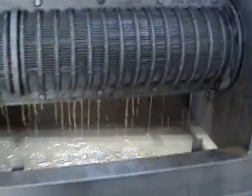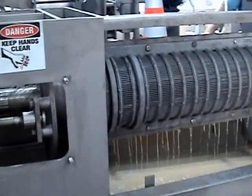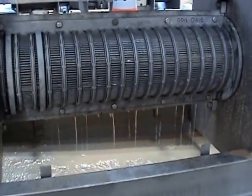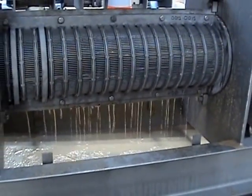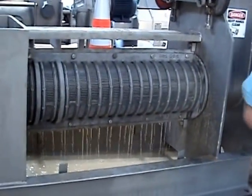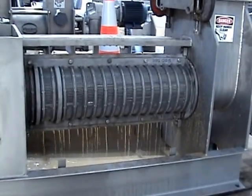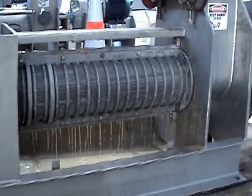We've got some material in the inlet hopper and getting some dewatering. In a few seconds, the screw is going to stop and the press is going to run backwards. The screw ramps up to 120 hertz for about five seconds. When we go backwards, we're wiping the screen clear with the material that's in there — we get a heavier flow. The screw has stopped and now it's started going forward again. We have programmed the VFD to go forward for almost a minute at 10 RPM, then back up at 40 RPM for about three seconds, with a one-second ramp up and ramp down. The press can operate forever this way without burning up the motor gearbox, wiping the screen clear.